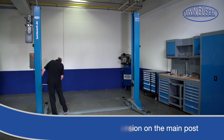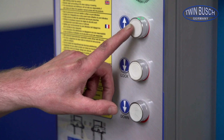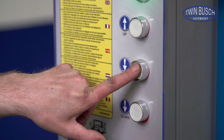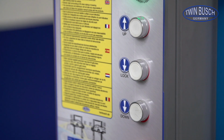Since the leveling cables are connected to one another, tensioning the main side now automatically leads to tensioning on the opposing side. Raise your lift upwards and pay attention to the clacking sound of the safety locks. The side with the hydraulic pump should click first, then the opposite side. The reason for this is that the main side has the shortest path to the hydraulic unit. The opposing side is forced to cooperate by the steel leveling cables.